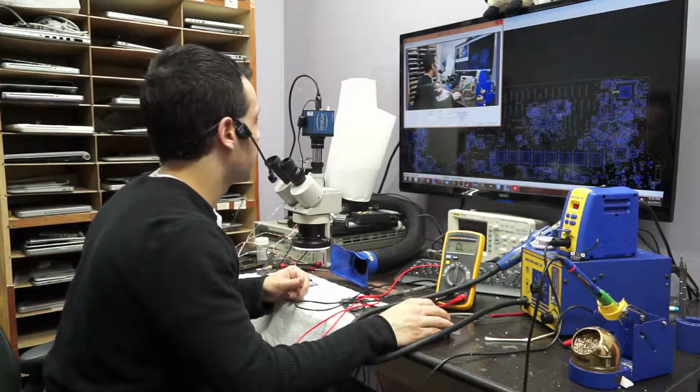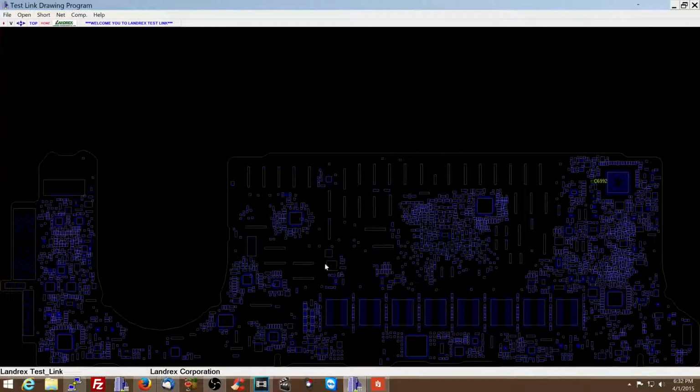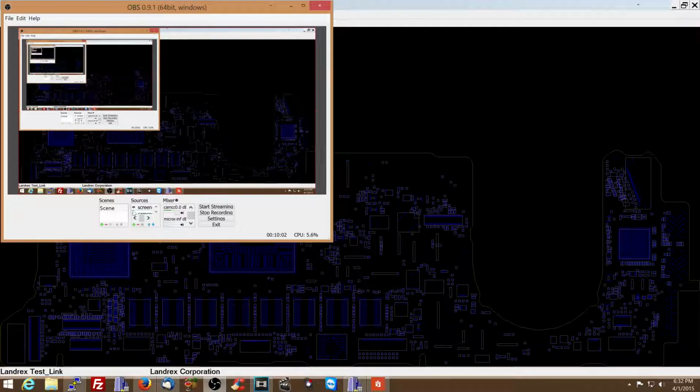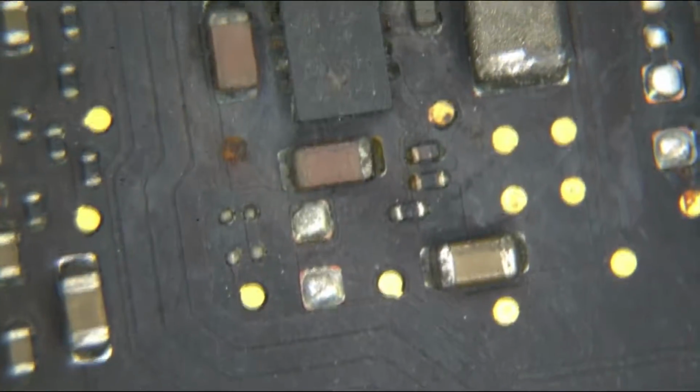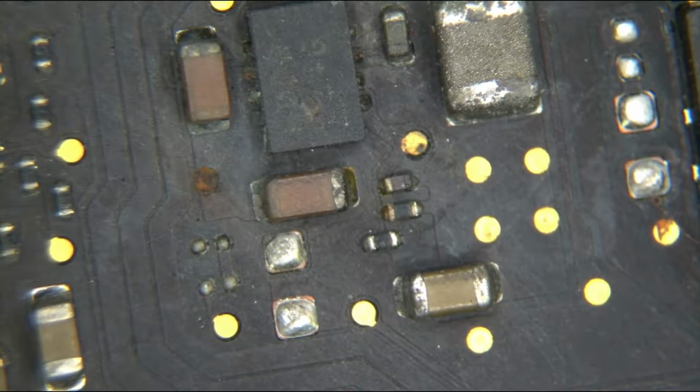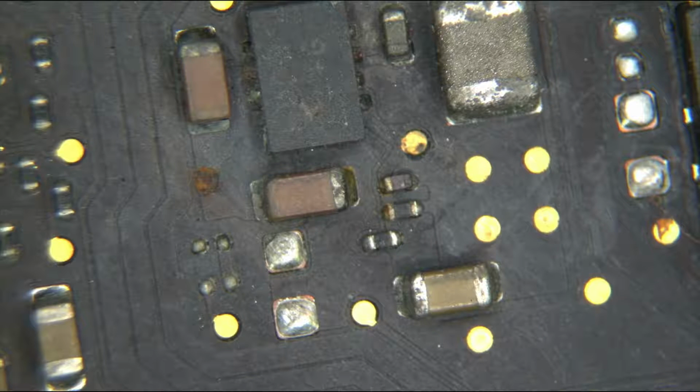So we're going to go over and find the other ones. Alright, where is C6990 and C6991? So up there. Since I'm turning the board, I have the unique opportunity to actually put the board in the view that it is in the software. So we're going to look at those two capacitors and see what we have. Yuck. Alright, so that entire section could use replacing. That's going to be the chip that creates PP3V42_G3 hot, along with the inductor. And those two smoothing capacitors on input to the chip that creates PP3V42.